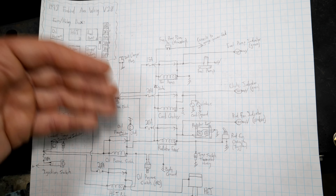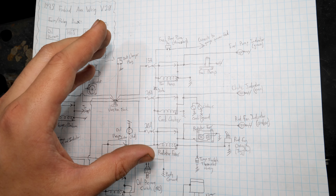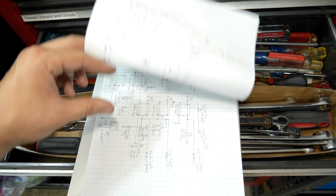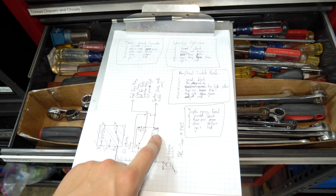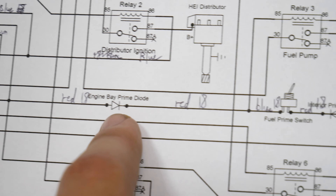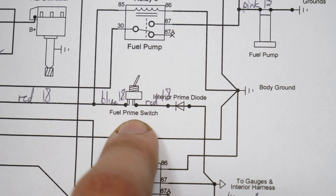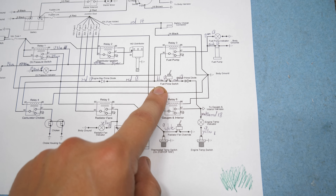I like this solution because it was simple and kind of elegant — almost elegant as far as anything I've ever designed goes. But as a whole, there's a lot going on here and plenty to go wrong if I don't wire it correctly. So I think I'm just going to go through and completely organize this data and update that wiring diagram. It's a hell of a lot cleaner than all the chicken scratch. Most of the changes were pretty minor. One of the more significant ones was adding a second diode for the fuel prime switch. I realized if this circuit was energized and you closed that switch — which you shouldn't do — you'd be bypassing the fuses.